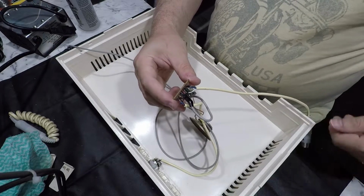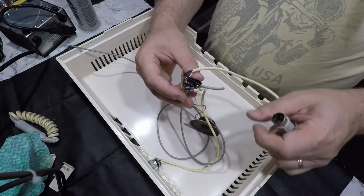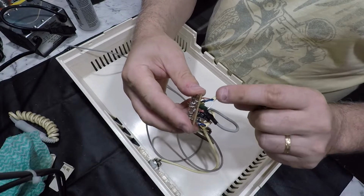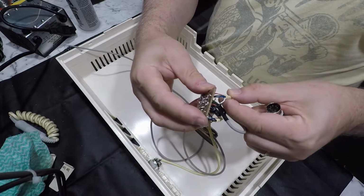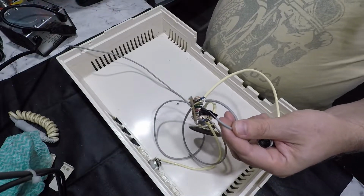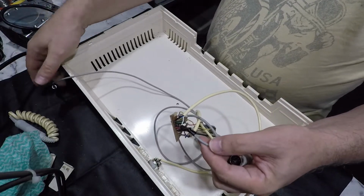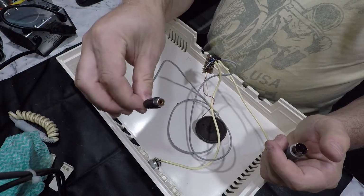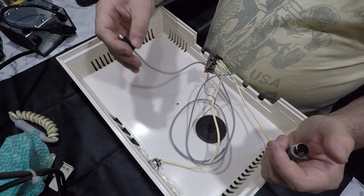There's one pin out of this 5-pin connector in here that's going, if we can see, straight from this cable, which looks to be a bit of old 2-pair phone cable. It's going straight out here. So I reckon that's what they've done. They've brought the video in on this cable and they're passing it straight out on this one. So it's not an audio out at all.